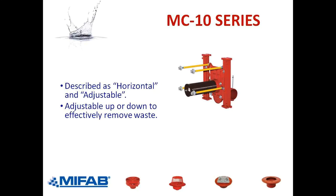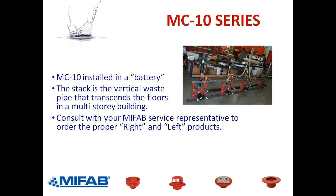There's a track that the faceplate rides up or down within the two legs of the carrier. The other adjustment is the fitting adjustment behind the faceplate — that fitting goes up or down. Why? Imagine five toilets in a row in a movie theater: they're all going to be at the same height, you're not going to have a slope to those toilets. The faceplate adjustment gets that desired height. The second adjustment, behind the faceplate, adjusts the fitting up or down to accommodate slope — so we're sloping the waste to the stack.